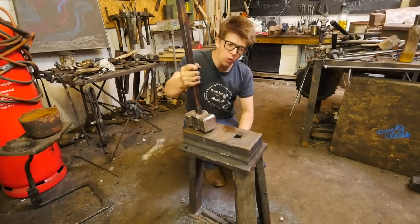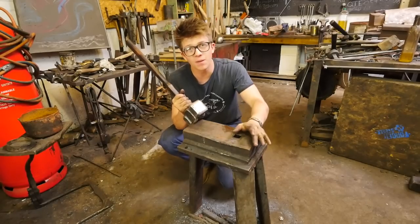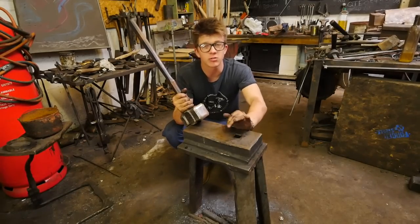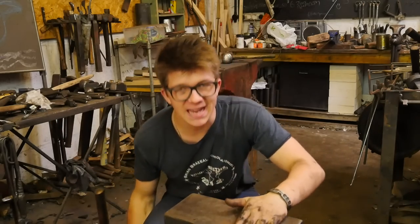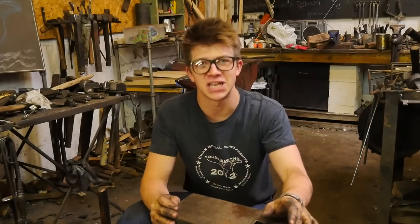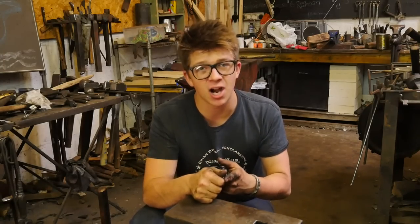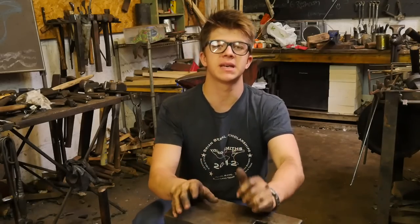The top on this striking anvil is made of mild steel. The reason for that is I'm doing a lot of work with beginner strikers. A beginner striker is very likely to miss, and that's okay — it's perfectly fine to miss, especially if you've got a striking anvil. Nothing bad happens if you miss-hit and ding a mild steel striking anvil; all that happens is you're going to dent it. My students have made their fair share of dents. I've ground it flat a couple of times and put a little weld in for any serious issues, but really there aren't serious issues — it just dings. There are no chips taken out, which might happen if you hit a high-carbon face steel anvil. You hit that edge, you can take a chip out and that thing will fly off like a bullet. If that lands in somebody's femoral artery, that's a problem. This soft anvil is great for the beginner striker as it means we're a lot safer.